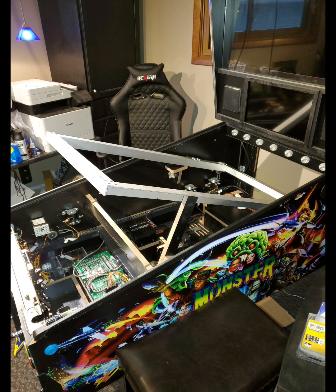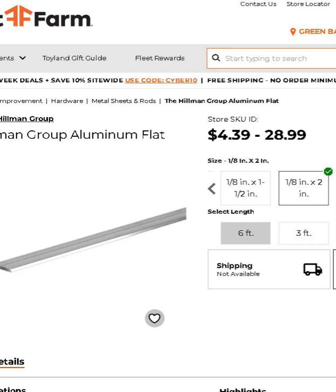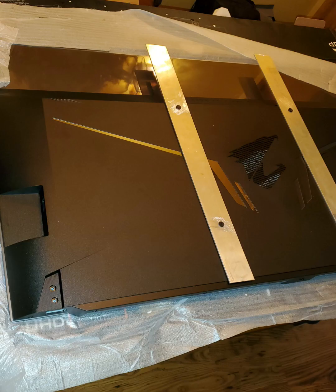We can lift it up and down and everything is perfect. We also bought a wider aluminum flat bar for the cross beams, which we will attach to the VESA mount of the TV. Measure from the bottom of the TV to the first hole, then measure between both holes, and drill accordingly.